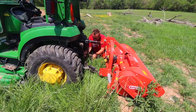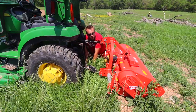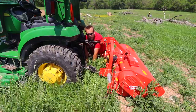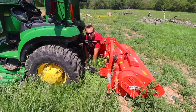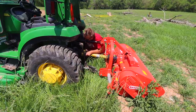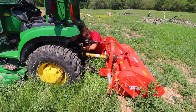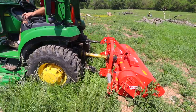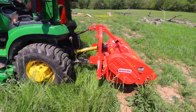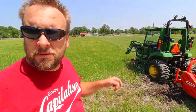I haven't seen anything that tells me I have to shut the tractor off to engage the PTO. But I've heard of another brand and another model that had an electrical issue on an electric PTO, and it would occasionally just engage itself. So I shut it off every time. First run will be with the mid-mount mower.